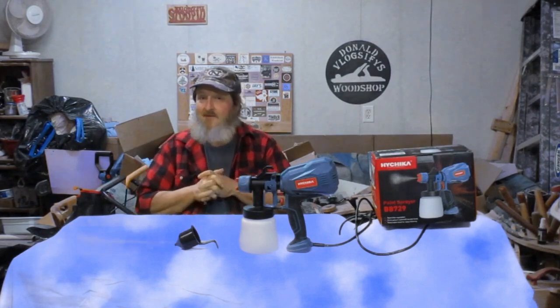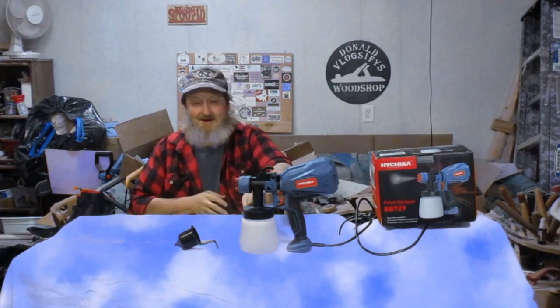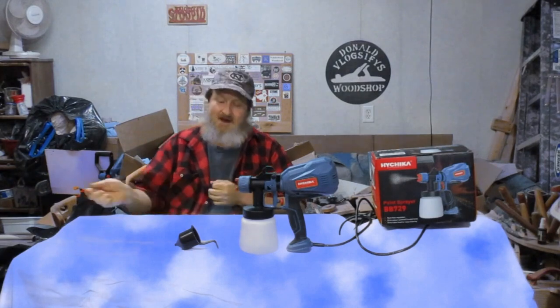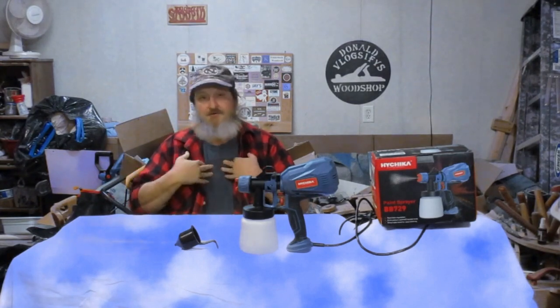There you have it — that was the last part of this cradle build video series. The sprayer worked great. There was a lot of learning curve for me; I've never used one before, neither pneumatic nor electric. When you first start using a sprayer, if you're new to it, you might want to try it with some paint. I jumped right into using shellac, which has thin viscosity and seemed to make it a little more difficult to spray. During one moment you saw, the cup wasn't on tight enough and there was a lot of leaking, so I had to stop and do some brushing out and smoothing where the drops were. All of that was only my lack of knowledge.